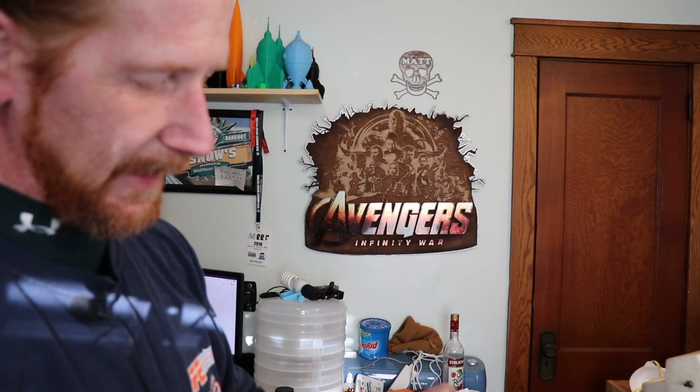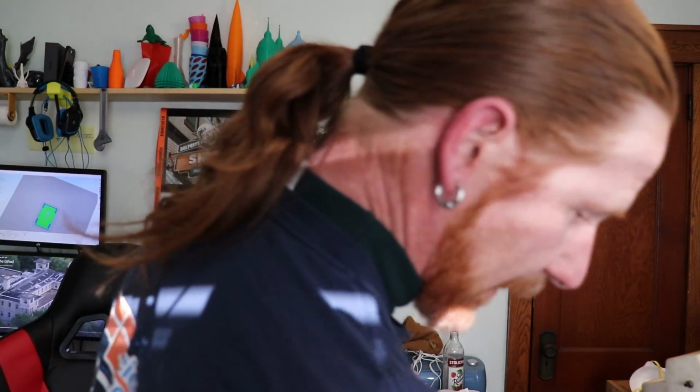I believe that my next investment, which I'm going to talk about here real quick in concluding this... So I'm going to say, as far as using mortar mix as a mold making material for casting metal, it's not worth it. Just the effort to chisel it out alone was not worth it. Not to mention the fact that I did have some cracks that caused a little bit of imperfections. Also, mixing Plaster of Paris with it at a separating line just didn't work, so the rose was a complete failure from the get-go. It was an inexpensive experimentation, but wasn't a complete failure.